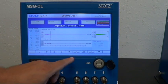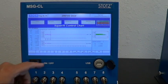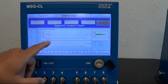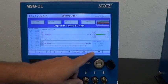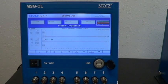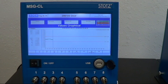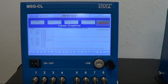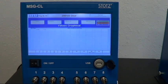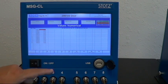We also have the XS chart, and we can change it to an XR chart. We can go in and look at individual samples and see the data in there. Then we get our histogram again. The next display plots every individual measurement graphically — not a five-piece sample, each one — and you can scroll through. You can see I had one little outlier up there when I started. And then it gives all the values numerically as well.